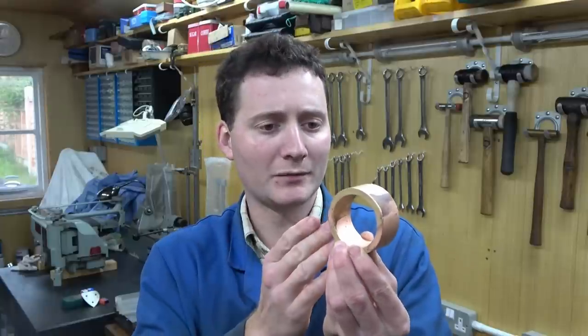It's still, I believe, going to take the form I want it to, but I'm actually going to change my plan slightly. I was going to shape this, machine the other one, set it all up, and then silver solder them back together. But silver solder is a little fussy, and I think this, if it starts playing up, could affect the success of a silver soldering operation, so I'm actually going to go for a screwed fit in the end. But apart from that, that's where we are. So on to a bit of machining.